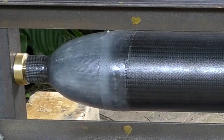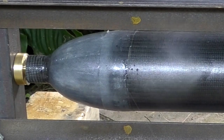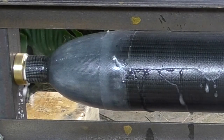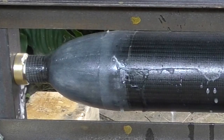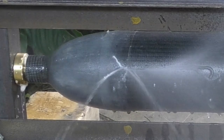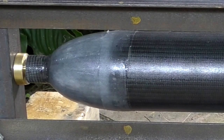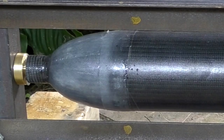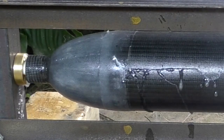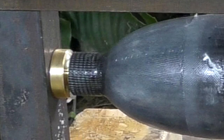In slow motion you can see the air making its way under the outer fiberglass layer. Although this layer cracked, the pressure chamber is still holding around 900 PSI at that point. Toggling back and forth from 0 to 900 PSI, you can see water make its way under the entire patch we applied — it finds its way out under the thinner layer on the body. The patch was still holding at around 800 PSI. We can see white frothy water coming out near the nozzle.